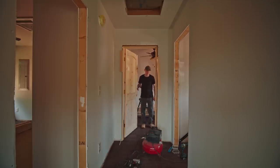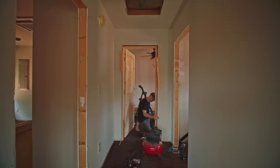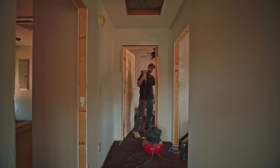That's what a trim man does — I'm hiding all the shims and all the gaps. If you're doing it yourself, just spend some time, don't rush, don't get distracted, and you can do as good a job as a professional — you just got to take your time. When it comes to shims, you can put them every 8, 10, or 12 inches — it all depends on how it feels. Grab a hold of that door jamb, try to shake it and move it, and see if there's any play in it. You just go from top to bottom all around, and you can even see that shim right there — the dark spot.